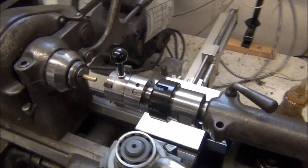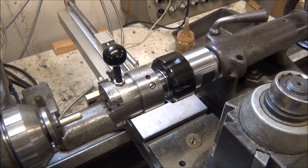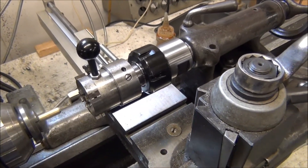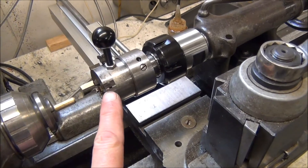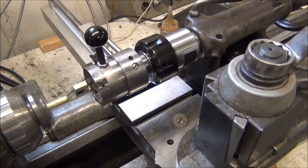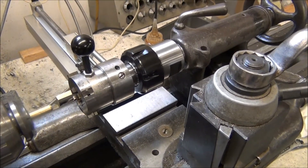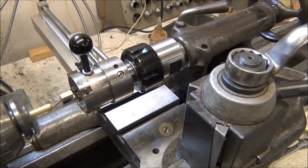Anyhow, let's get back to the Rubometric die head. These are also called geometric, but those are brand names. The Rubometric takes the DS and D style dies, and they're the same as geometric dies. So you can outfit these — a very useful tool to have, especially if you need to do a lot of threading.